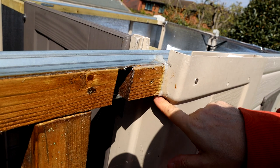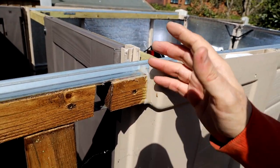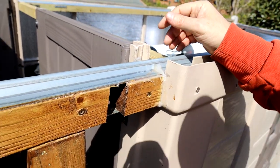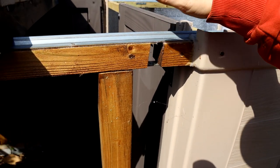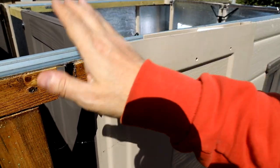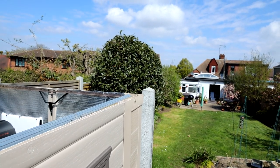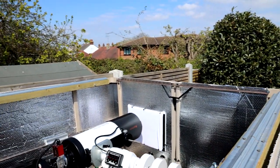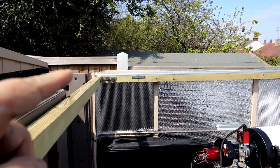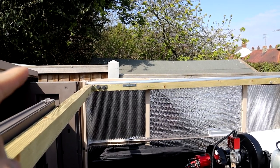This is one of the cuts that I made - I worked it out roughly with a smaller piece of wood, got the angle, then just literally cut that with a saw across. I made sure the angle was slightly downward away from the observatory. I put this in because the plastic isn't that strong and I wanted to make sure there wasn't too much weight on it. The rail is three metres in length so I had to join two bits together, and the same goes with the wood - I butted them together and they've got steel plates either side just holding it together, with the rail on top helping to secure that as well.